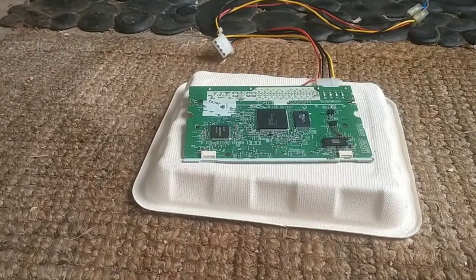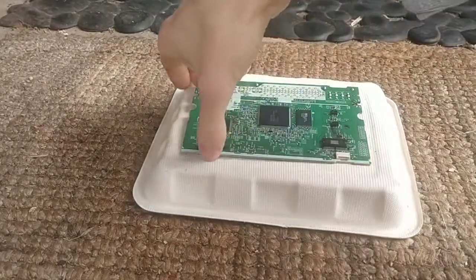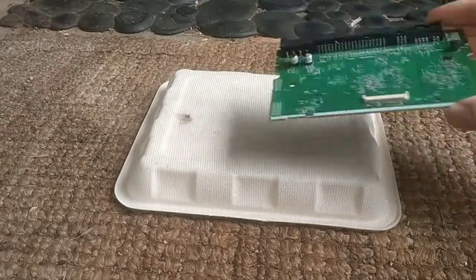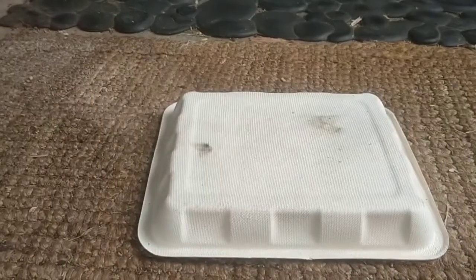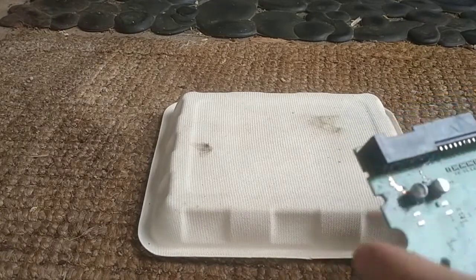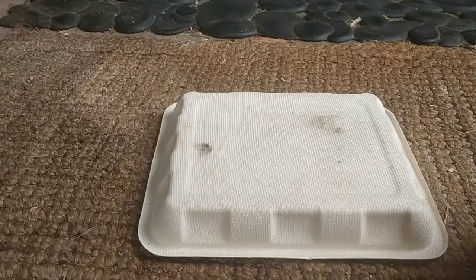Let's inspect. I've unplugged it, just to show you that I unplug things before I start poking around. Left a bit of spatter on the board I was doing it on — it's an old meat tray from the butcher. The plug, by the looks of it, survived. The solder mask looks burnt off that trace there, and there's some muck — probably electrolytes from the capacitors.